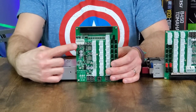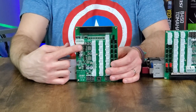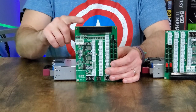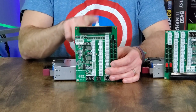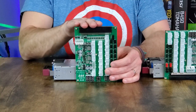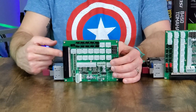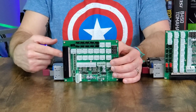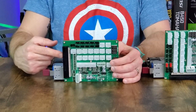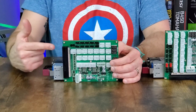The board also highlights the remote section where you can plug into a remote adapter, as well as dual mini 4-pin daisy chain connector plugs that allow you to hook multiple server power supplies up to this one breakout board, powering on all subsequent supplies with just the power from this board. The board has a built-in power button and supports up to 2400 watts — the same amount supplied by the Delta 2400 watt unit from Parallel Miner.